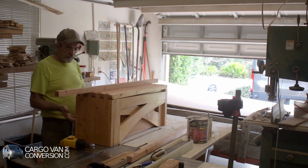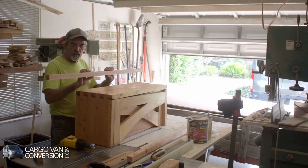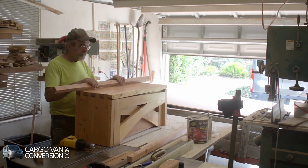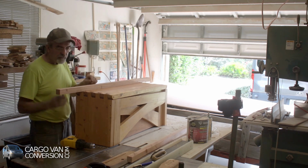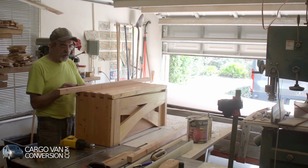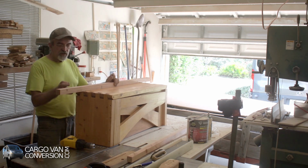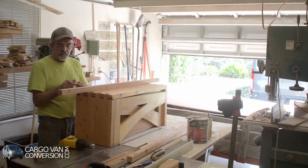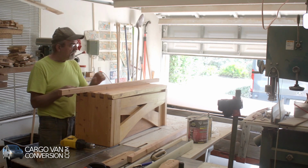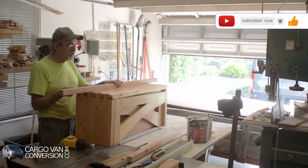When it's set up with the legs open, I have two separate boards. Put some holes in there, put some coupling nuts in the workbench itself, at several points, and then just when I set up the bench, I'll just add the two pieces, one on each side, bolt them in, and assumably have a solid workbench.